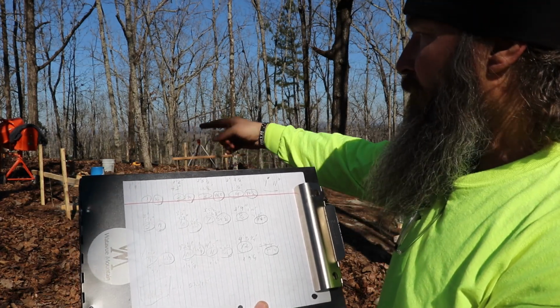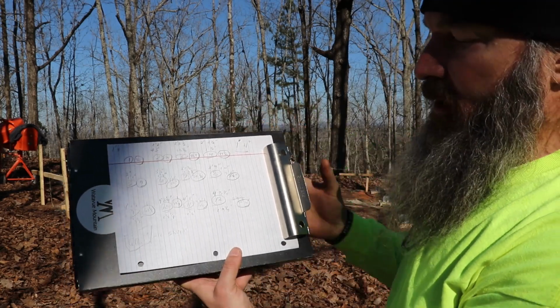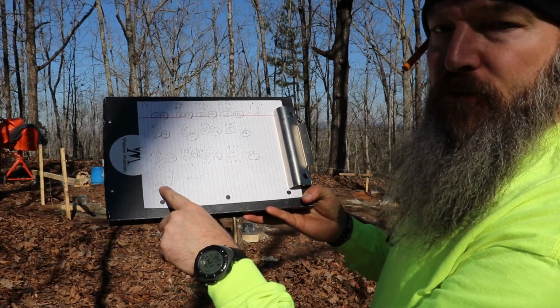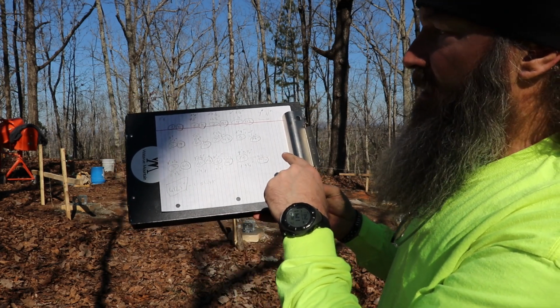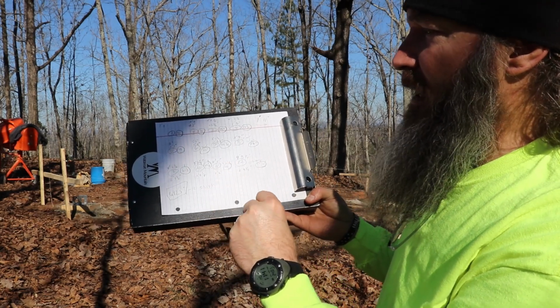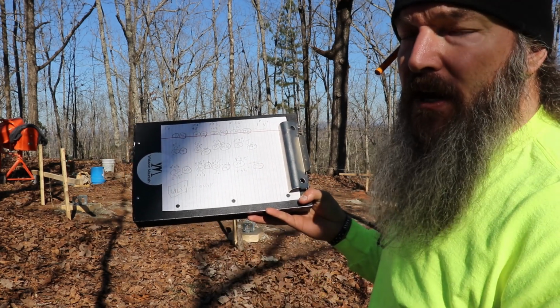I'll cut it, I'll write on the actual post number one, so I know that it goes right here in this corner. And then as we keep going, I did all the math to figure out we need 642 and a half inches of post, which comes out to be 53 feet. I have six by sixes that are 12 feet long, so that comes out to 72 feet altogether. Plus I have a piece from Jerry and Norma,